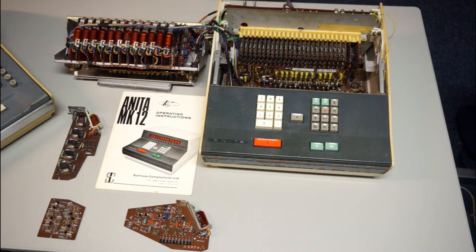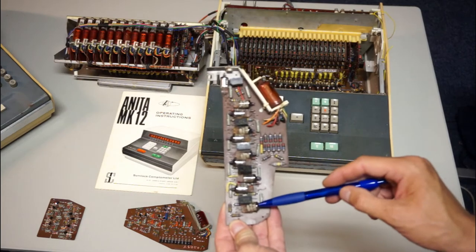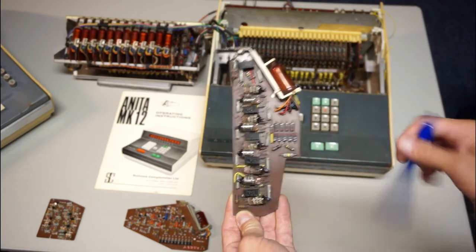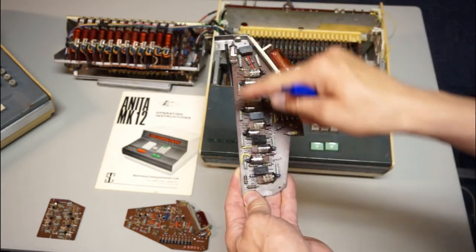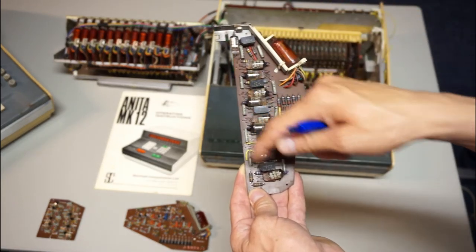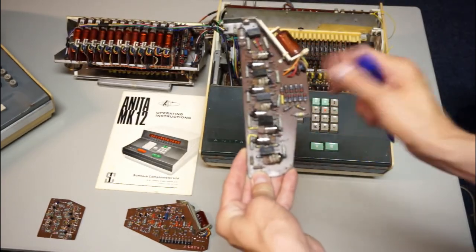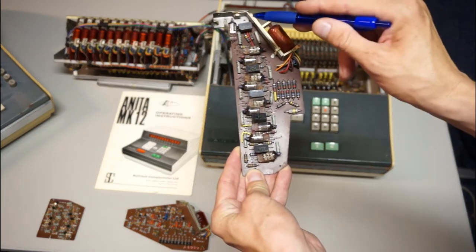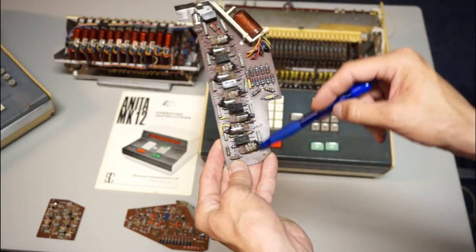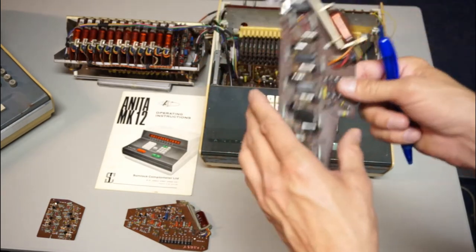Designing the ANITA Mark 8 — in that machine they used very many trigger tubes, about 170 or 180 of these trigger tubes connected on each number card. They're connected as a ring counter, so every pulse the next neon will light up and go back — it goes round. When you reset the Mark 8 the number goes to zero, and you clock pulses in, and when it's at 9 and goes back to zero, it carries out a carry pulse. That is the only way for the machine to know what was in the number card.